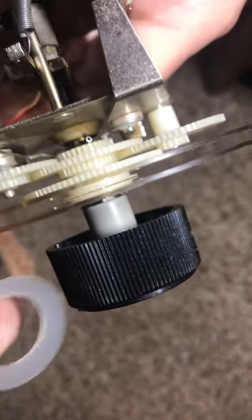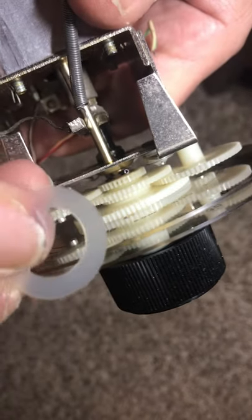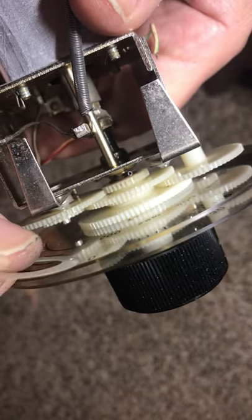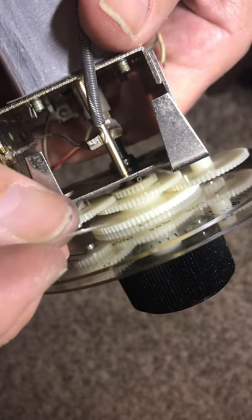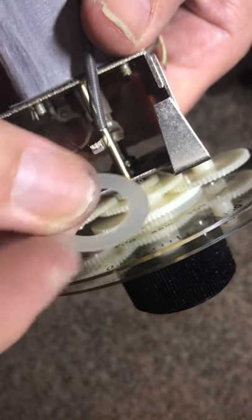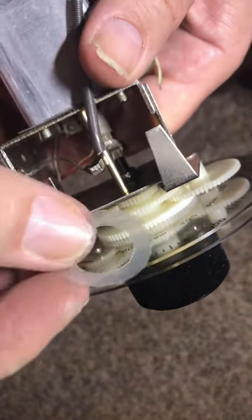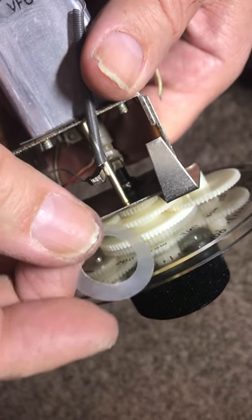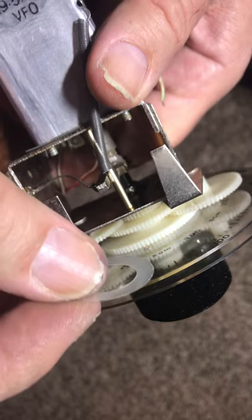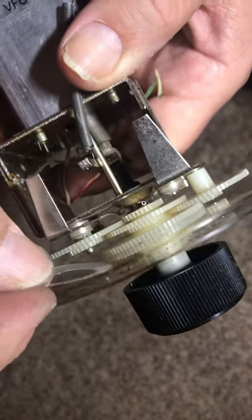The other PTO from the T4XB had this washer in it. I pulled this one out and it seems like it works better — this kind of made the gears not mesh. This is a thick washer; there's also a very thin one in here. This one causes chatter and causes the gears to be a little non-linear.